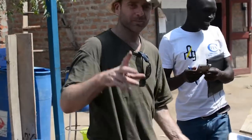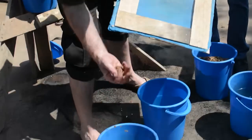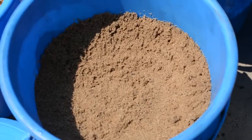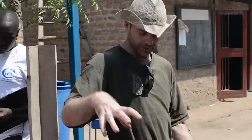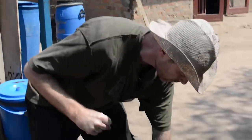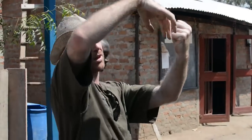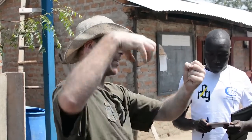If you just put it through the fine screen you get this good coarse stuff, which is what you want. But you also get really fine sand, and that fine sand basically turns into cement when it gets wet, so the water can't get through. Because if you imagine that's a grain of sand and you've got other grains of sand near it, there's enough space between them that water can get through. But if you've got really tiny little bits of sand, they fill up all of those spaces and then the water can't get through.